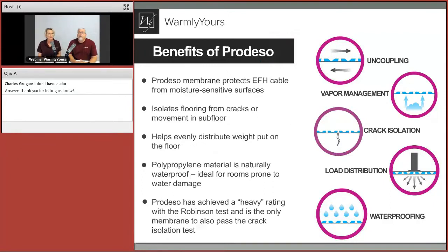As it relates to electric floor heating, the main thing is having those grooves and channels that you can quickly weave the heating element through. The ProDESO does five different things at the same time. EFH stands for electric floor heating cable. It isolates and uncouples the subfloor from the tile. Vapor management is the next feature — it actually lets you put tile over a concrete slab that isn't fully cured yet, recirculating the vapor back into the slab.